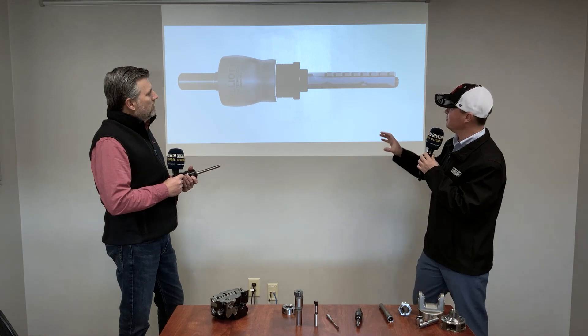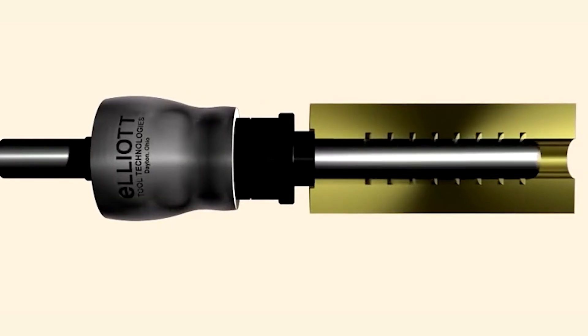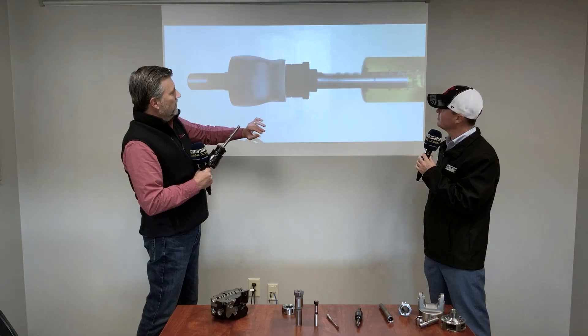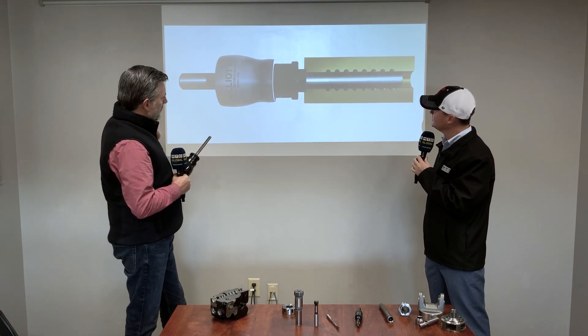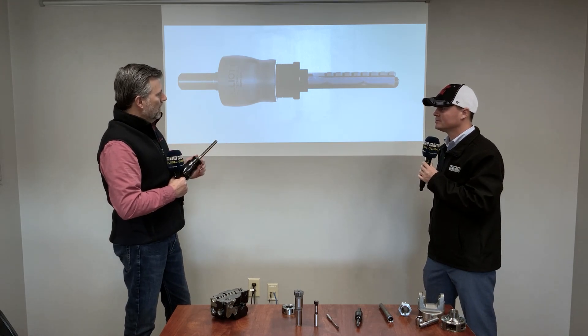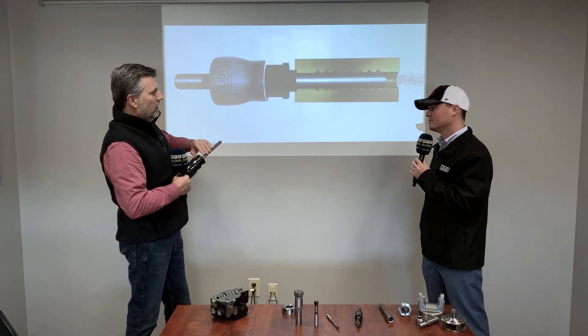As we can see in this video, these teeth on the tool are kind of within the tool itself until it gets to the area where it needs to make a cut, and a spring pops them out. It's a mechanically actuated tool — spring-assisted for accurate actuation and retraction. We've got a series of ramps and cams built in — you can see those pins right there. As we make contact with the face of the part or the counterbore, once we make contact and continue to feed in the Z-axis, we get a lifting of the cutter straight up to machine these grooves, or lands.